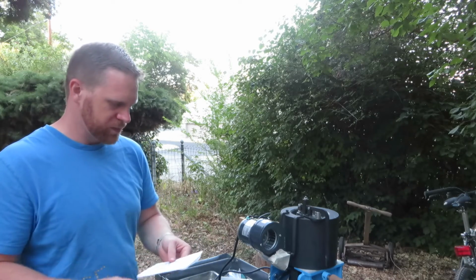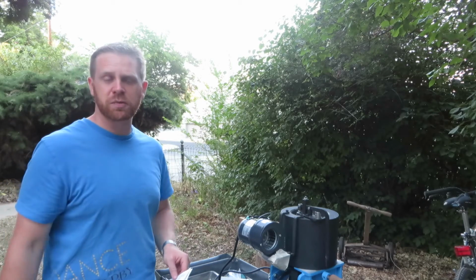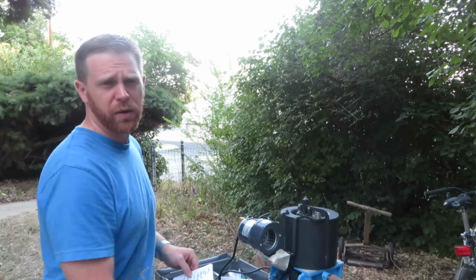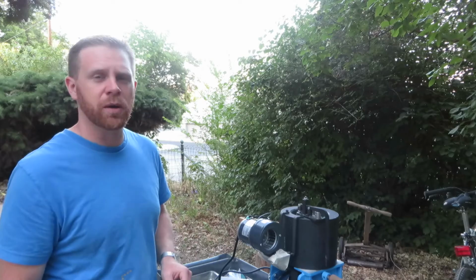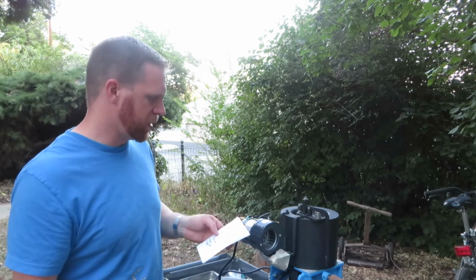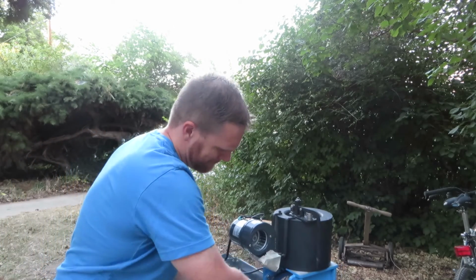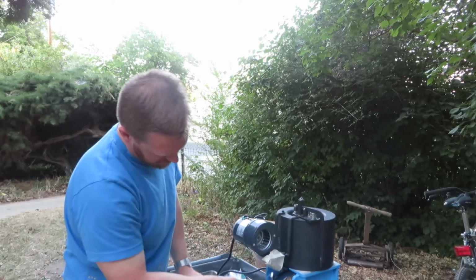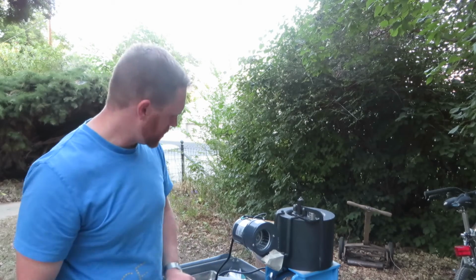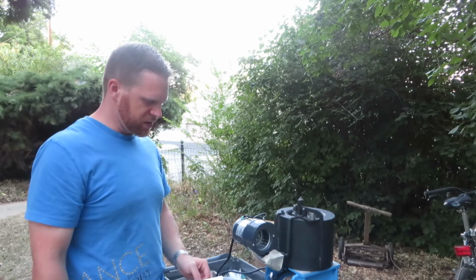Anyway, some cons are the cost, that it's a pain to get in there and change out the orifice plate or clean the orifice plate, which I find you have to do more than I would like to. You can't just poke a wire up there and swish it around like you can with a bottom pour pot generally, but you actually do have the ability to service it, so that's both a pro and a con. It's kind of a pain to change the molds. You have to punch out a roll pin here and here, or remove these Allen screws. They do provide you nice punches and Allen wrenches for that, but it's not as convenient as I think it could be.